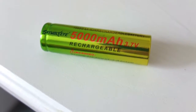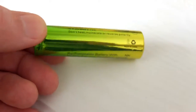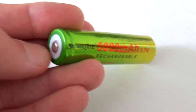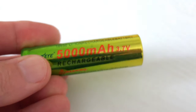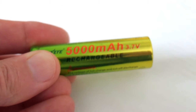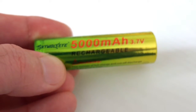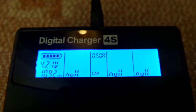Just a very quick video today on some lithium batteries I've been testing. This particular one is called Skywolf Eye — it's got quite a nice label with a green metallic effect, and it has a rated capacity of 5,000 milliamp hours. Any 18650 with that on the label has to be slightly dubious, so I ran it through the tester and got 1,092 milliamp hours on that cell.